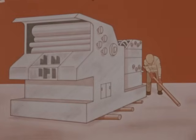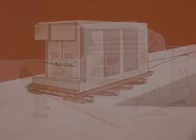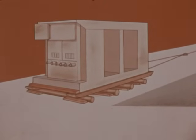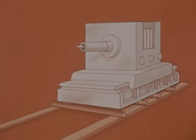As the rear roll becomes free, it should be moved to the front of the load to maintain equal spacing between the rolls. Caution should be taken in all roller operations that hands and feet are not caught under the rolls. Rolls should always be used when moving a load up a ramp; chock the rolls to prevent the load from moving backwards. Changes in direction can be made by striking the rolls near the end with a sledge in the direction the turn is to be made. Always chock the rolls when leaving the job for an extended period or at the end of the working day. The use of 2x10 planks will provide a smooth track for the rolls when moving a load over rough floors, macadam, or hard dirt.